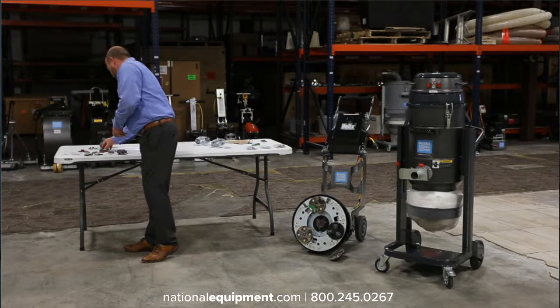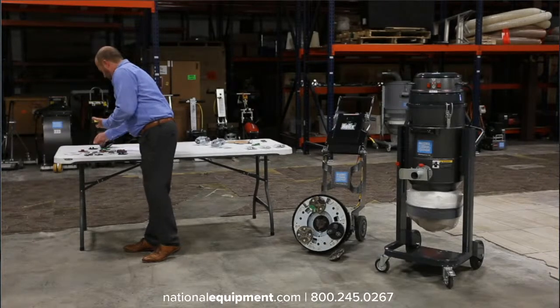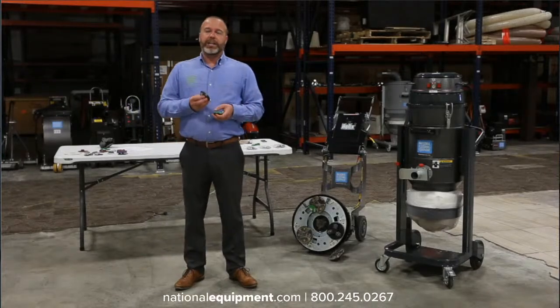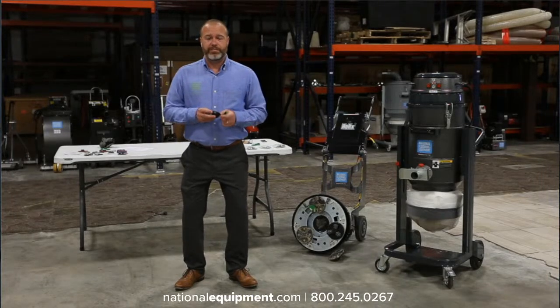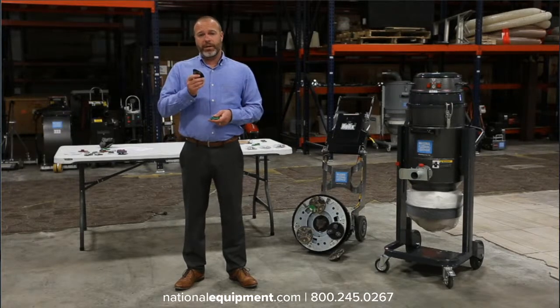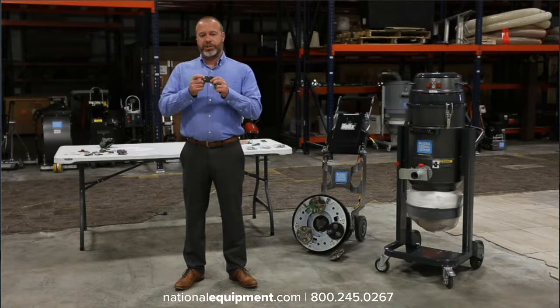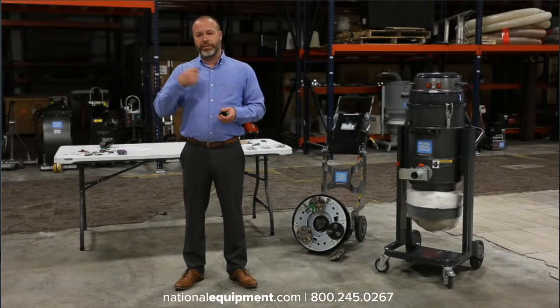The traditional method for removing glue too is looking at half bar diamonds. So if you're noticing that you don't really need to be aggressive, maybe it's not a super thick coating, so you want to go with the least aggressive method that you can, these half bar diamonds are going to be great for that, because it gives a lot of pressure per segment of the diamonds, but it also allows that diamond to scrape the glue off of the floor.